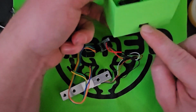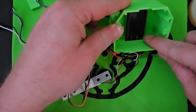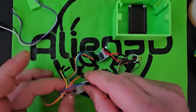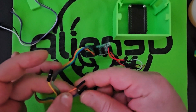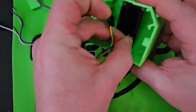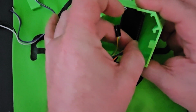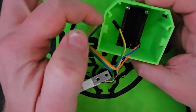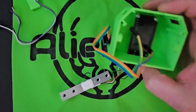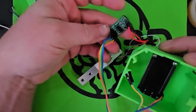if you're looking with the USB port this way, on this side, these first 2 pins are VIN and ground. And so you're going to want to stick the VIN to the VCC. That's a 5-volt connection. And then the ground on the ground. And the green and yellow, make sure you got the order right on here. So the yellow is the clock.